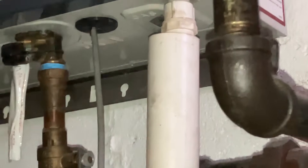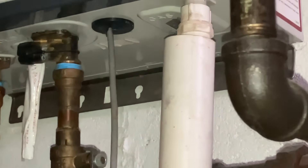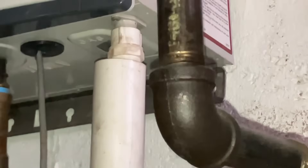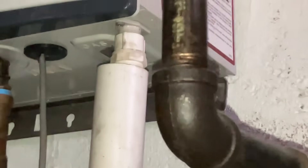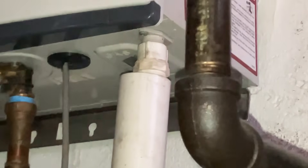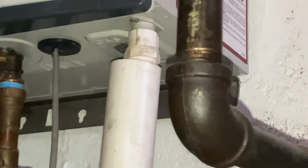So there are a few things wrong with the installation — we'll start with that. You have a tankless water heater. It's a box that hangs on the wall and it instantaneously flash-heats the water. As water passes through it, it heats on demand. They're energy efficient and they save space. I wish it wasn't installed where it is because we have to take apart the vent piping for the boiler to get to it.